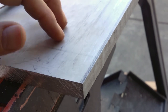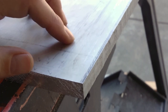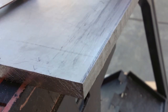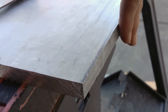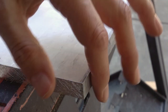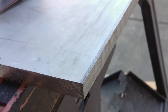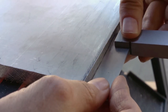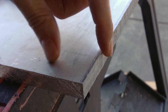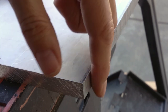Next thing I'm going to do is sand this down and take down the high spots. This is a butted edge and it has to be accurate. There are other measurements based off this too, so it has to be square and fairly straight. We can take a look and see that we have high spots - if I try to tighten the machine together it would wear down these high spots and it'll never stay tightened well.